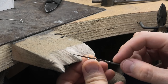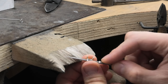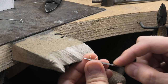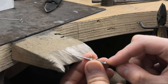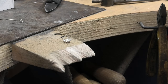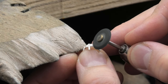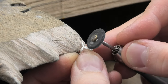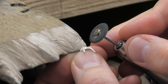I'm going to give that little centre collet a bit of attention, give it a bit of love - making sure there's no little lumps of solder anywhere, any awkward little file marks. Be careful when you're putting your files on it; you don't want to end up putting a nick in a claw. My soldering is super neat if I do say so myself, but it can still be improved with a rubber wheel. Rubber-wheeling the solder line away gets it really sharp and then after polishing it'll look really crisp and nice.